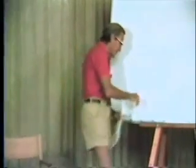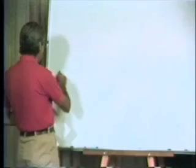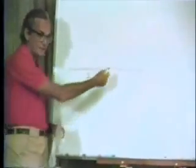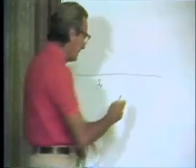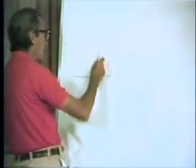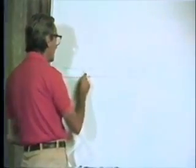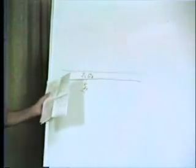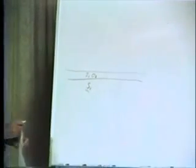What we do is to take some material. In this particular case, it's silicon. There's a layer of very beautifully made, very pure silicon. The reason is any piece of dirt or scratch or anything that's wrong with it is a great big monster boulder at this scale, and you don't want any dirt. So you get very pure silicon. And then in a vacuum, you let in oxygen. What forms on the surface is a layer of a compound, silicon dioxide, which is simply quartz or sand or like glass. It's a thin layer of glass, which is an insulator. Silicon is a conductor. See, we're going to build this thing up.